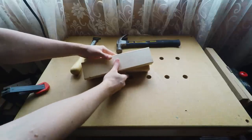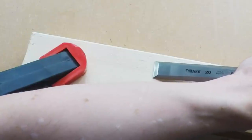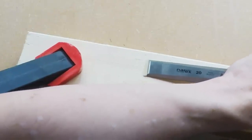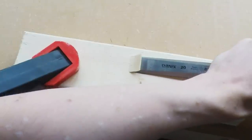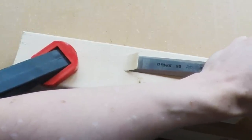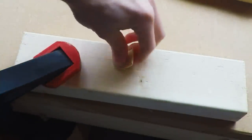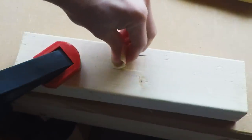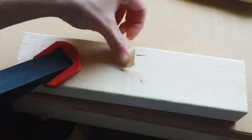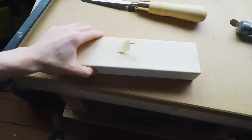Here's a different way that you can do it. I'm going to come in at a very shallow angle and just curl up a piece of the wood. You don't have to go very far, just enough to give you some space to actually get the screw in. It doesn't matter if it starts to crack and split, just as long as you keep all the pieces together. We'll drill a pilot hole and glue and screw it on to the next block of wood.